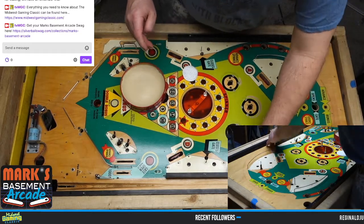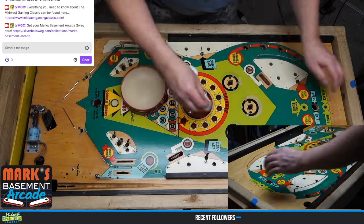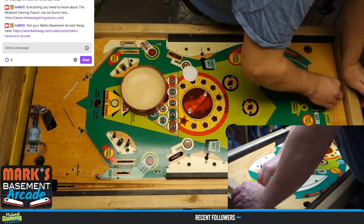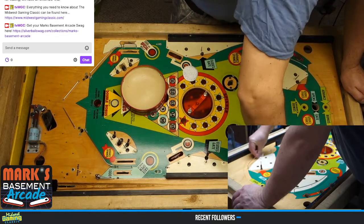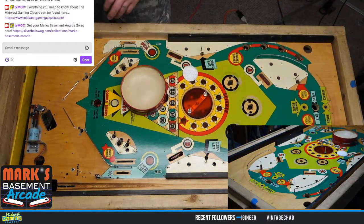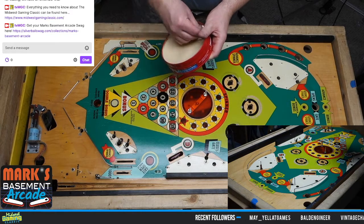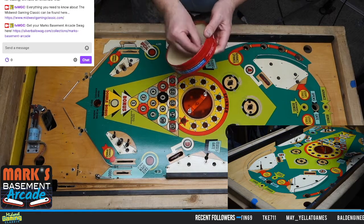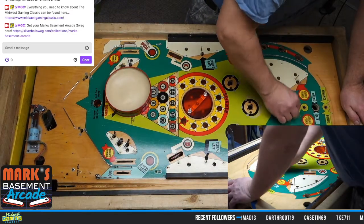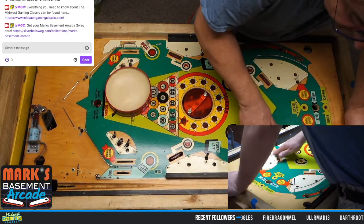But where that ball groove is, you get that from not replacing your balls when they're garbage. So you get those arches from years of garbage balls that have got little rust spots on them. So inspect your pinballs. Inspect them really good. This is garbage. If they get any signs of yuckiness on them, throw them out. Or another thing you can do is buy a rock tumbler and tumble them. And that will bring them back to normal too. If you do that often enough, you probably won't have to replace your balls for a long time.